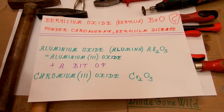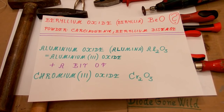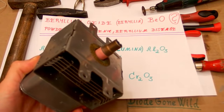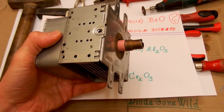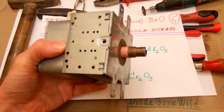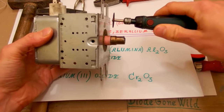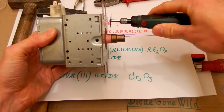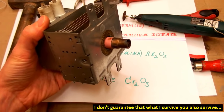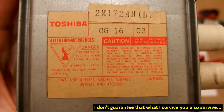They also don't run at such super high power as to require a beryllium oxide insulator. But of course I still have to cover myself — I can't give you a 100% guarantee that this is not beryllium oxide. Even if it is beryllium oxide, it's not so dangerous in its solid form; it's dangerous in its powder form when you can inhale it. So it's not a good idea to cut it with a saw, angle grinder, or Dremel. I'm going to cut the metal part of it, not the insulator. So let's start the autopsy.